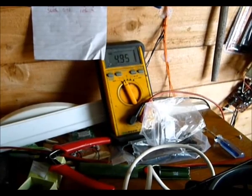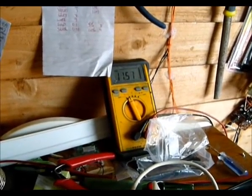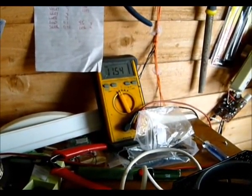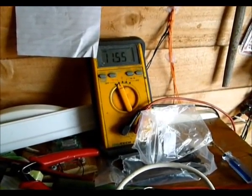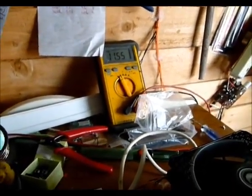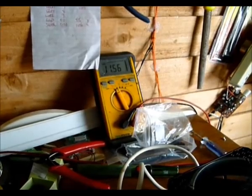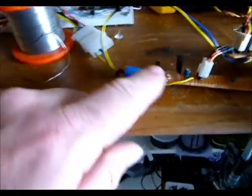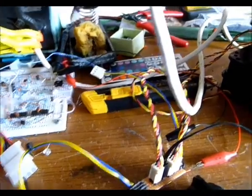Bringing the PWM cycle back up, I can see the range of speed. There you go - 11.55 volts, so I've dropped 0.4 of a volt at the maximum speed setting. My PWM cycle is 95% so I've got good full range. You may get a bit of a drop but it won't be that great - maybe 50 RPM off your top speed, so a 1500 RPM fan may run at 1450 or 1400. The circuit runs fast and everything stays nice and cool.